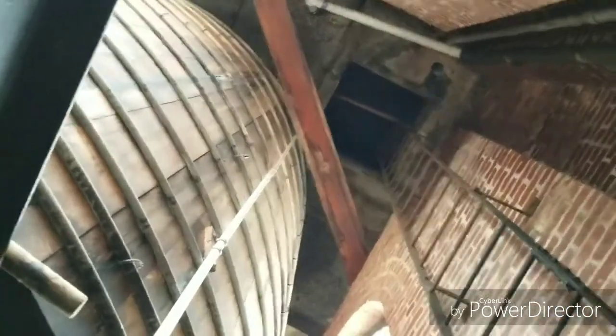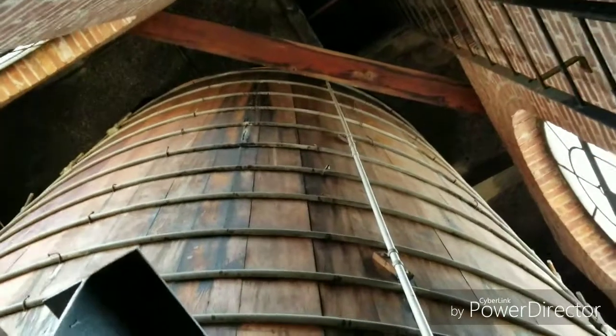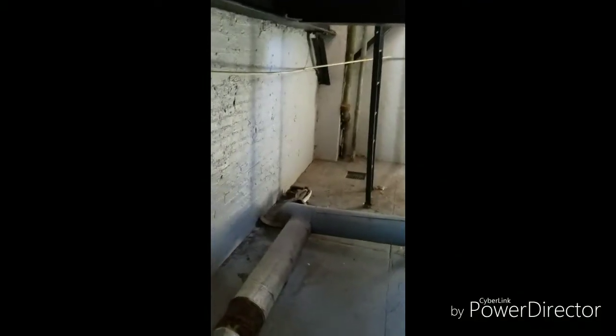I have some other videos I'm going to cut in to show you inside the tank. This is the bottom of the tank — that's your standpipe, the upfeed, and the downfeed. Here's the video of the water tower — we're at the bottom of it now. It's a 16,000 gallon redwood tank built inside a beautiful original Rosario Candela enclosure. This is our standpipe with the fire system — it comes out of the bottom of the tank. These are the two downfeed lines that supply the building with water. These are the fill lines that come from the pumps in the basement and fill the tank.